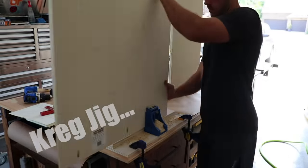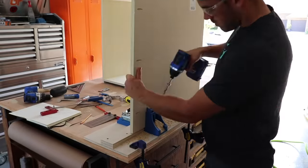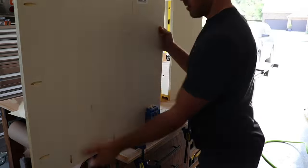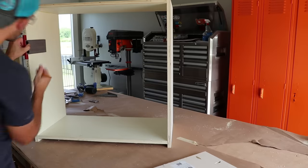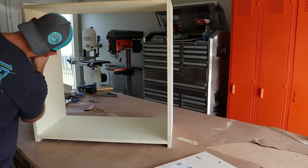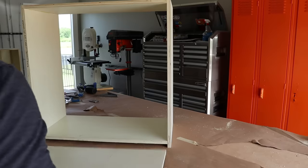This offset on the bottom piece is to mount the face frame, which we'll tackle later. Here's an example of where that Kreg Jig comes in handy. I'm measuring in three-quarters of an inch to install the cabinet back. This will allow a cleat system to hold the cabinet flush to the wall.